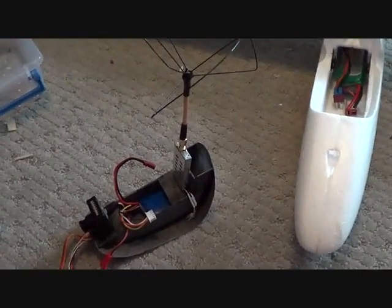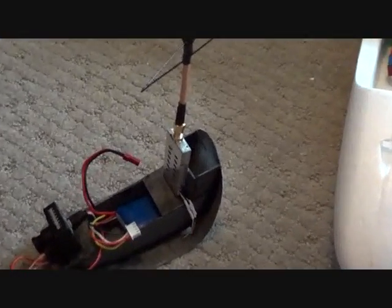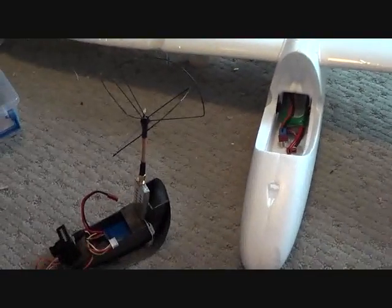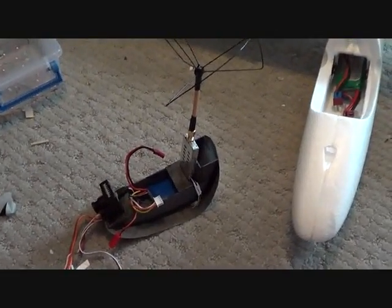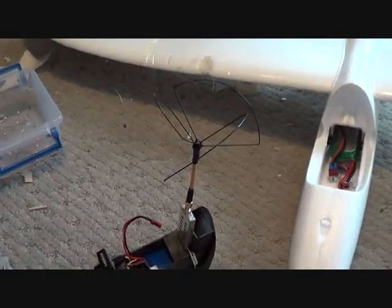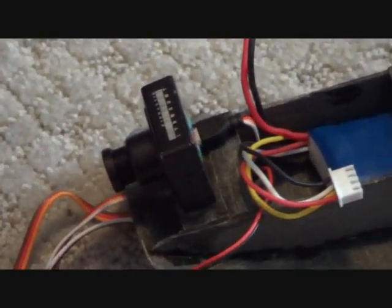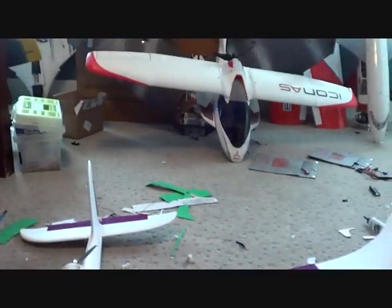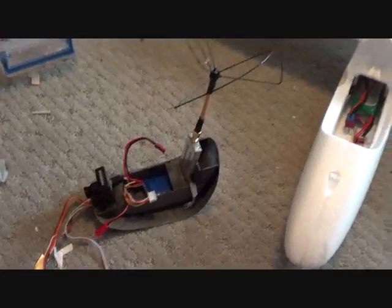I want to make clear real quick that I've used two antennas there, as well as two transmitters. If you don't believe me, there's transmitter number 1, and there is transmitter number 2. Those are the two that I've tested, same exact problem with each. So it is my belief that the transmitter is not causing this problem. Nor do I believe it was the transmitter antenna, because I've tried two. I've also tried two different cameras. I don't know if a camera tends to be a source for an issue, but again, camera number 2 is down there somewhere. I don't remember where I put it. So all those components have been swapped; the only constant here is that battery, but if batteries cause interference, I'm not sure. It shouldn't, I don't think.